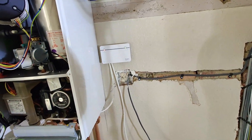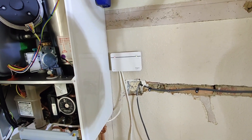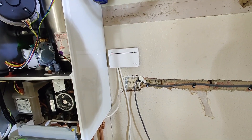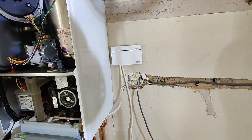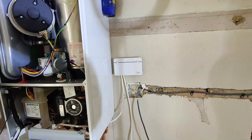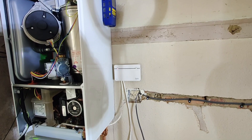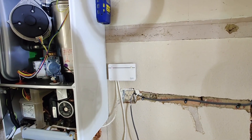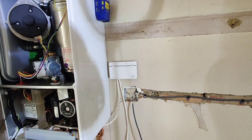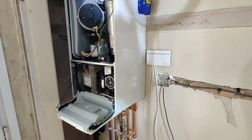When we create a demand and there is a demand on this thermostat, it's not making that contact. The relay is clicking - we can hear it clicking - but it's not bringing 230 back on this black cable. It's a brand new kit and once you've installed it and it's not working, you may start to doubt yourself that you may not have wired it up correctly. That's the first thing you want to check, but there is also a possibility we have a faulty thermostat, a faulty receiver base, or hub, out of the box. We need to carry out some testing to prove that.